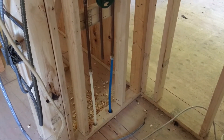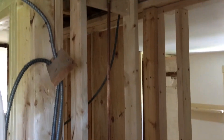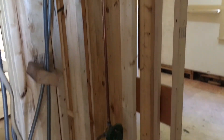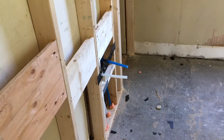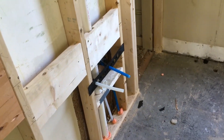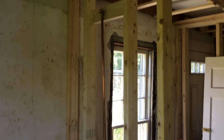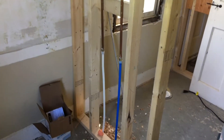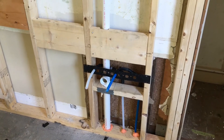Here in the bathroom, you can now see that the PEX comes in and feeds into the copper pipe at the mixing valve, and then that proceeds up to where the shower head will be. So this is now set up. With respect to plumbing, we also now looking in the downstairs bathroom have PEX water lines here for the sink, as well as PEX water lines coming up to where the shower mixing valve is. And again, that copper for the mixing valve was here already, but we now have the PEX lines running down to the basement. None of this in the basement at this point is connected or tied into anything — the rough lines are just there, ready to be hooked up.